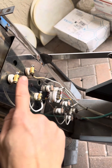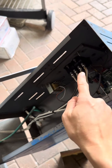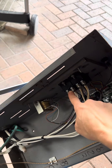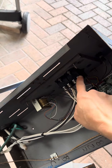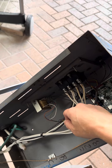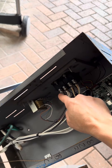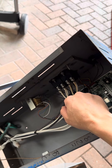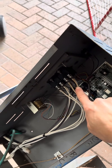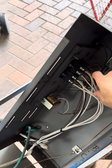So let's see where all these wires are going. They're coming out of your elements and going right into your relays. Your relays are what turns your elements on and off. On occasion they need a little maintenance — I just had one get stuck the other day, meaning the computer shut off but the relay got stuck and one of the elements never turned off. I had to manually unplug the kiln, and now I had the job of replacing these two relays.